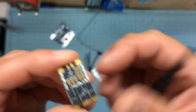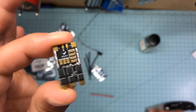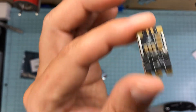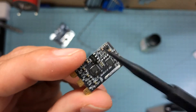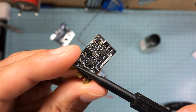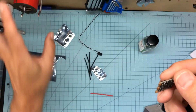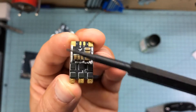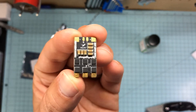These are actually going to go on a drone project of mine — it's a quad, but it's a GPS drone. I bought eight of these and I have four of them on my other quad, which I'll show you shortly. What I do is I conformal coat the back, then put good old fashioned 3M double-sided tape on them and stick them to the arms — trust me, they're not coming off. Then after I wire them up, I conformal coat the whole top and that's it.